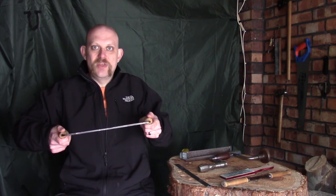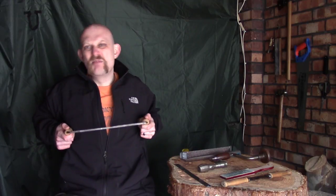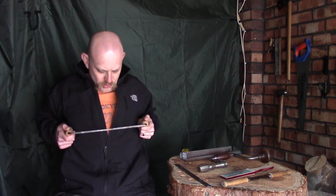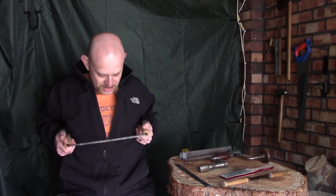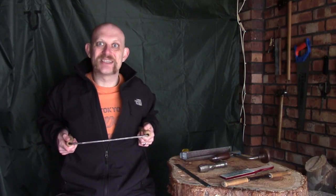Because most draw knives have handles about this width apart, they'll generally stop if they hit your body, making this quite a safe piece of equipment. If you do slip with it, the handles will hit you - you might give yourself a little bruise, but there's no way you can cut yourself using it in the correct manner. These are great little tools - you can pick them up from flea markets, car boot sales, or online auction sites. This one cost me about £10 or £15. It wasn't in the best condition, but I cleaned it up, got the rust off, sharpened the blade, and put the handles on myself. Making the handles was actually one of my very first YouTube videos.